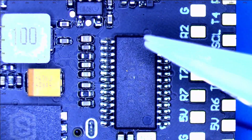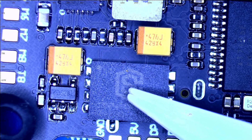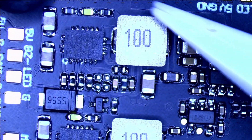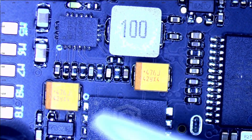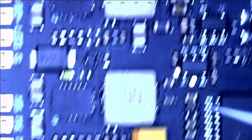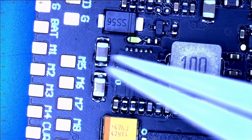Right here we've got a beautiful OSD chip - yes, onboard OSD. You've got your onboard 512 flash. Over here you're going to find your two different BECs - here's BEC one and here is BEC two. We've got some nice capacitance cleaning everything up, and there is an LC filter on board - that's really nice. That's where you take capacitance and inductance to create a low pass filter to cut out frequencies you don't want so you're not introducing unnecessary noise. Your flight controller has every pad broken out on the bottom and on the top everything in plugs - they just made your life simple.